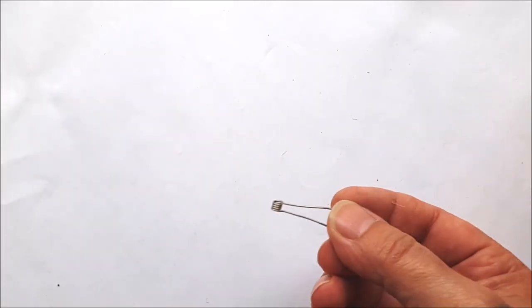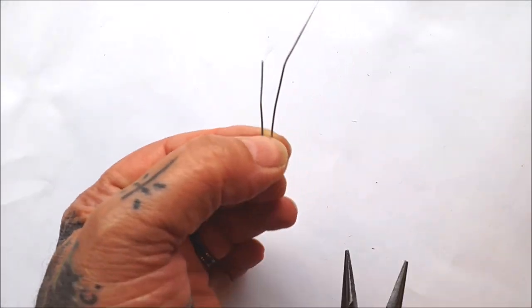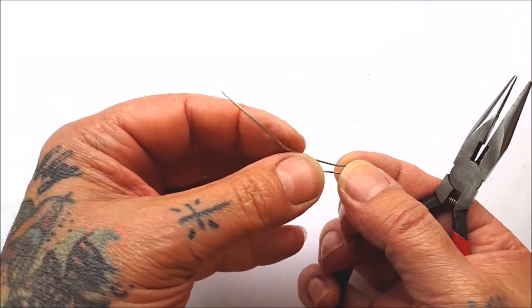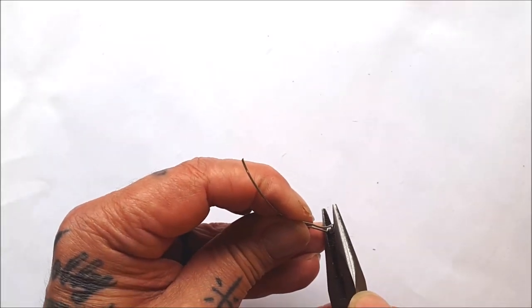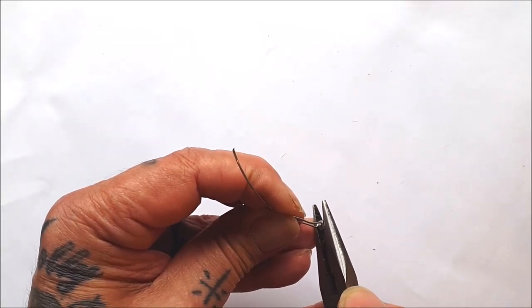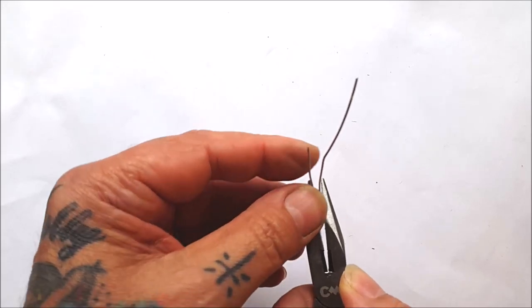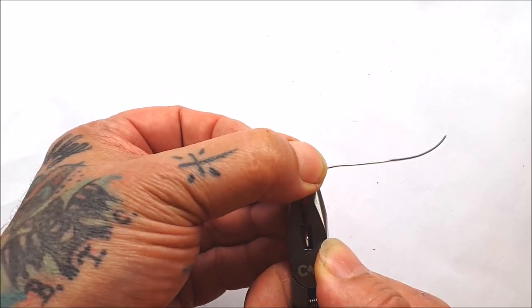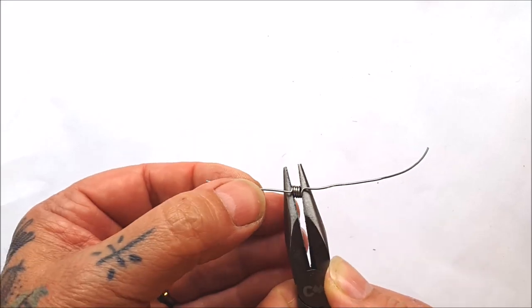Next thing we need to do is pre-bend these legs. There's a video down in my channel where I do this in detail, but I'll just do it quick and run through it. So all I'm going to do is hold that in the pliers, just so the top of the coil's level with the top of the jaws of the pliers. I'm going to bend one leg one way, and one leg the other way, about like that.